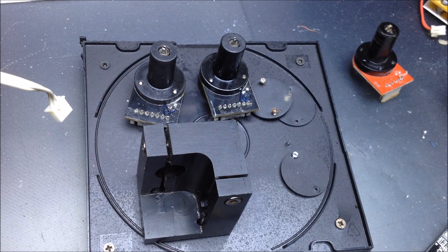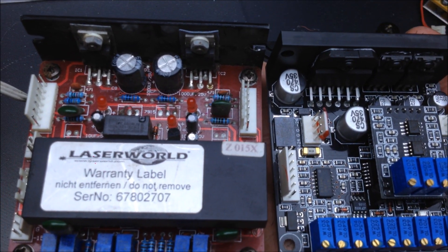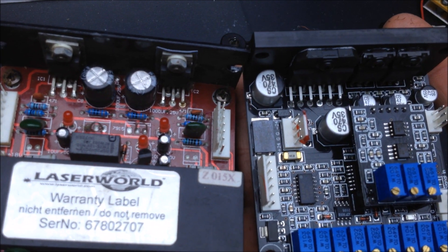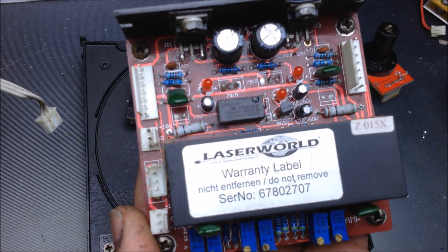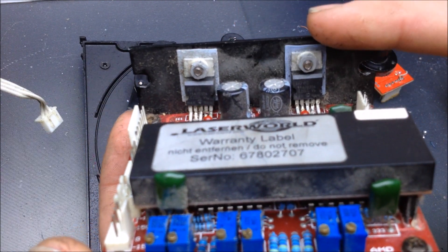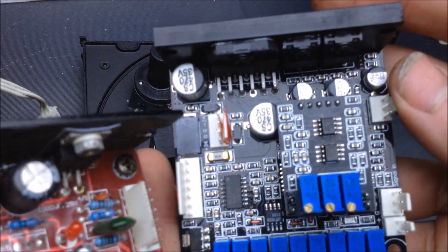Like a speaker, these have amplifiers, and there are two types that are pretty common — one like this and one like this. The biggest difference between these two amps is that one is designed to control both the X and the Y axis, and the other is an independent one that only controls a single axis. This one has two outputs and is a fairly simple galvo controller for a 15 KPPS system, and just uses these two TDA2030A amplifiers. Same thing with this one, except it's for a single channel — you'd imagine it like a left or right channel.